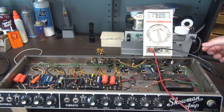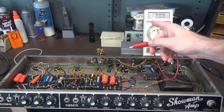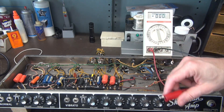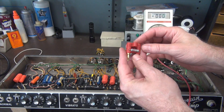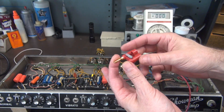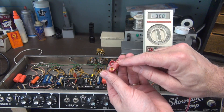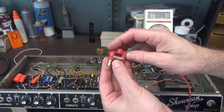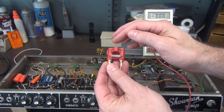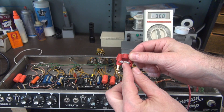So obviously you're going to take your voltmeter, connect your negative to chassis, and then your positive to verify that the voltages are dead. Wouldn't it be cool if at the same time you're checking those voltages, your meter would also dissipate them? Here's a simple way to do it. This is one of those little banana jack stackers — you can buy these for next to nothing. These two prongs plug into your meter; it has to be a standard meter with three-quarter inch spacing. Then you plug your meter leads in here. The cool part is you can parallel a little resistor right in there — there are set screws down inside. You insert your resistor, tighten them up, pop in your leads, and now every time you use your meter, you are injecting this load which will discharge the caps.